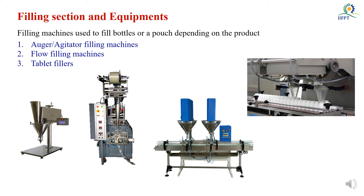The second type is flow filling machines, used in continuous operations particularly for liquid food items and also powdered items with proper gravity values and easy free-flowing properties. Another form of Moringa powder available today is tablets — the powder is compressed and converted into tablet form. These tablets are filled in plastic containers on a count basis, for example 50 tablets or 25 tablets per container, using tablet filler machines.